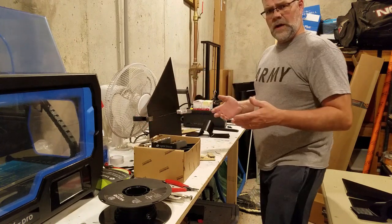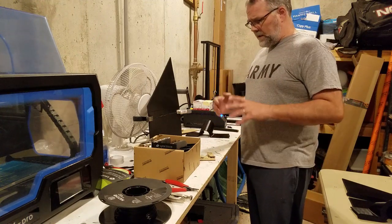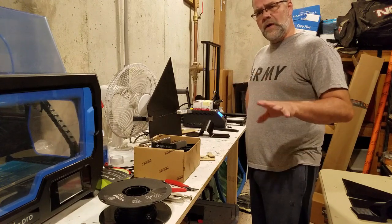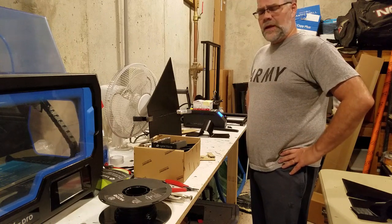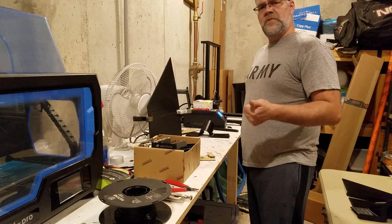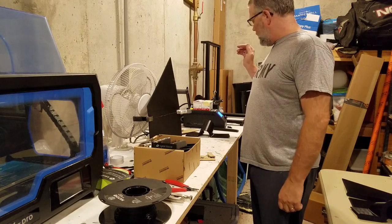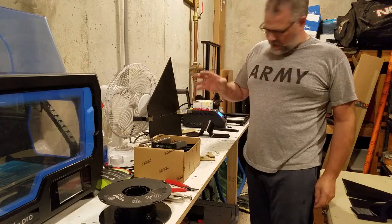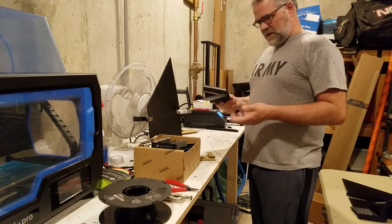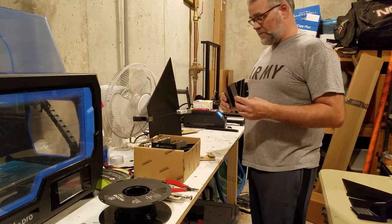I like to stand it up. This is a quick-drying epoxy so I'll just let this dry, do all the rest, and in the next video we'll get it all together and start preparing for carbon fiber skinning, which we'll cover in great detail. On the printer side, I use Simplify 3D as the slicer. When making these parts, you only have to design one side — you pull it into Simplify 3D, mirror it around the Y-axis, and you've got a passenger side and a driver's side. Absolutely fantastic.